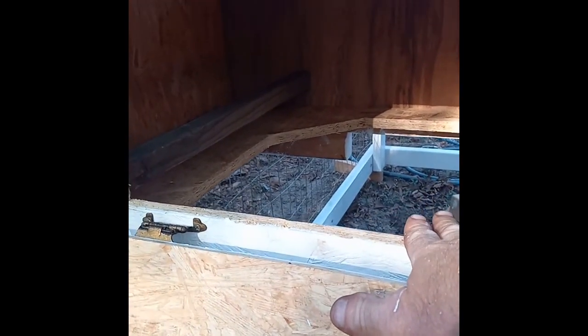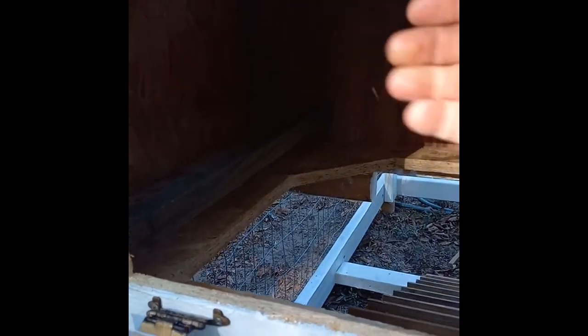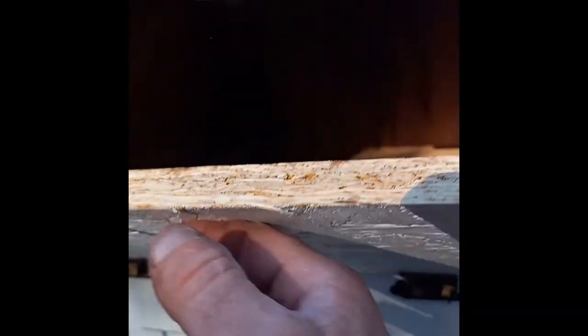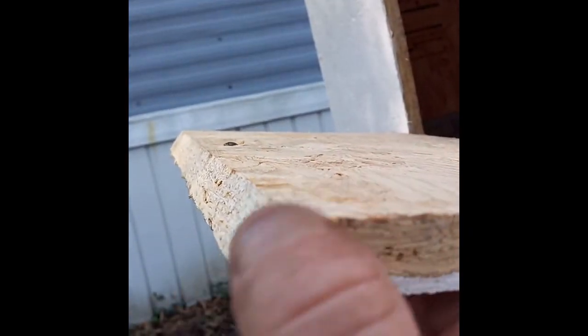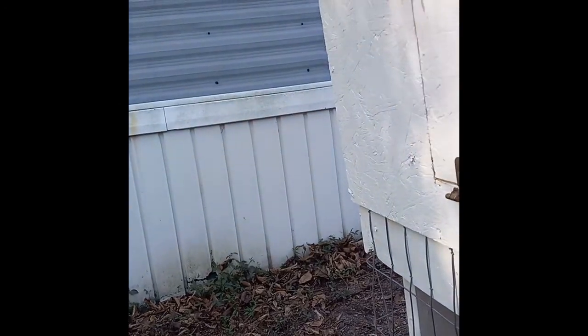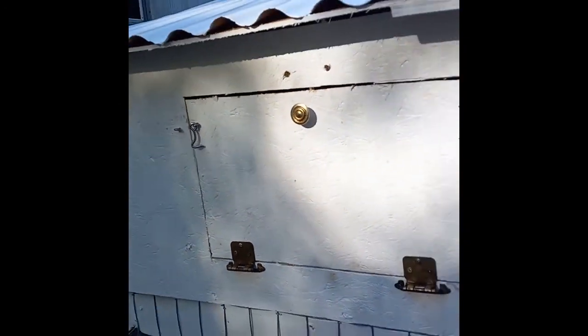you've probably already used them before, so you probably discovered this on your own. When you go to push it in, if there's nothing to catch it, so what I've got is a 2x4 block here screwed into the back to give it a catch lip. And another big hint, cut the top edge at a 45, bevel it in, and it'll close right up, won't catch. So we're gonna do some touch-up paint and get it on the truck and get it delivered.